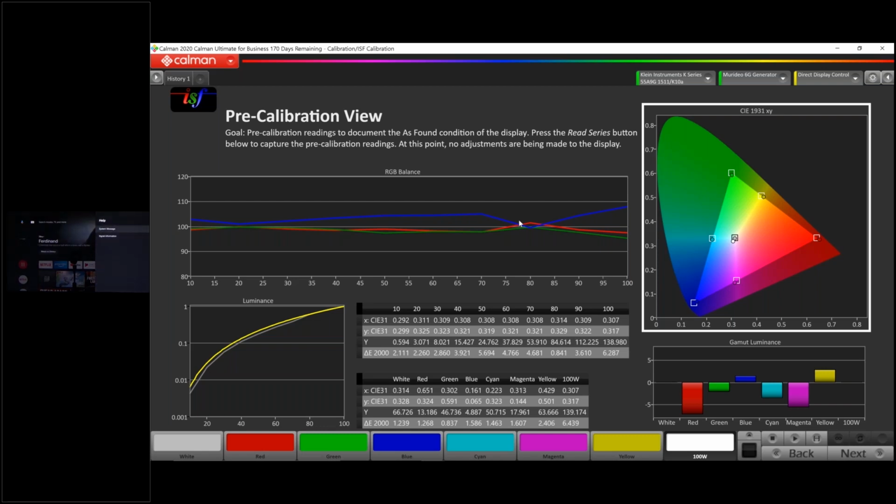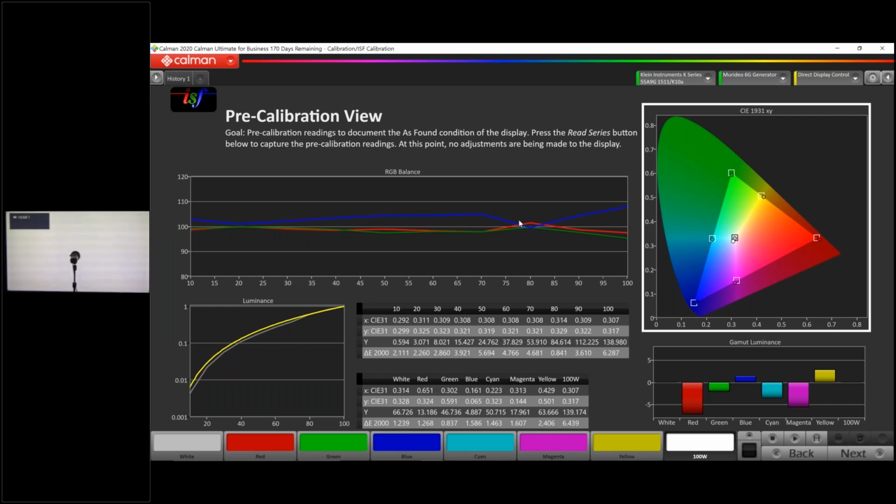We're going to go to system message, and we're going to check down here the software version. The last 5 digits are what we're really worried about here, and that's K1016. And that does seem to be the latest, and that's what a lot of people were reporting on the forums and whatnot. So we're definitely up to date here. So let's switch back over to HDMI 1 so we can get the test pattern generator back on the screen, and then we can dig into it and start to take some measurements here.